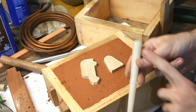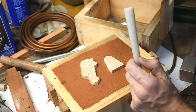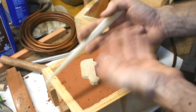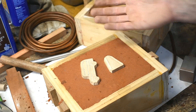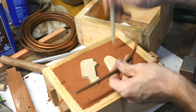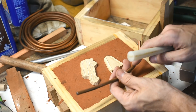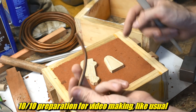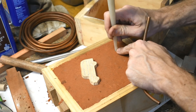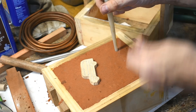So this new system — I have my tapered sprue former. I also have the pouring basin on top, so I pour into a basin and then it overflows into this. That's important too, but I don't have a print to share with you regarding that step of the system at the moment. This goes in here somewhere. This is too long — my tubing cutter is in my toolbox, which is in my work truck, which is not here. Pretend this is shorter. When you're ramming these up, I tend to push it in just a little bit to hold it, although it is always kind of tippy until you get sand piled up around it.